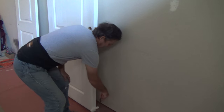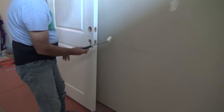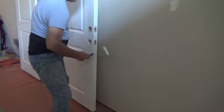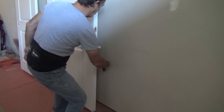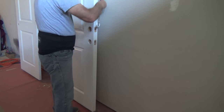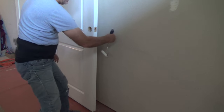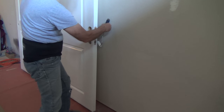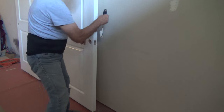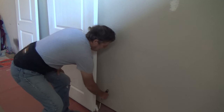That's why I got the door up off the craft paper with my screws. Then I can take the back side of the roller and roll it on the front, or take it on the back and carefully hit that edge at about a 30-degree angle — not a 45 — so that if there is any buildup on the back side, I'm going to get it.